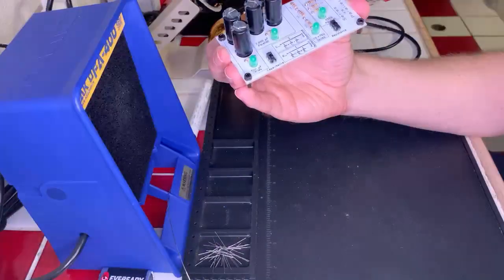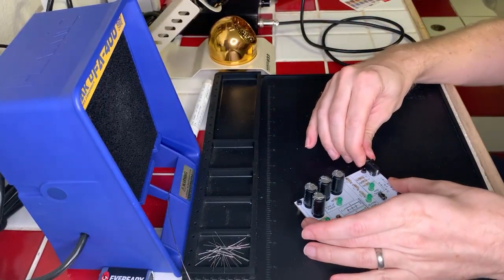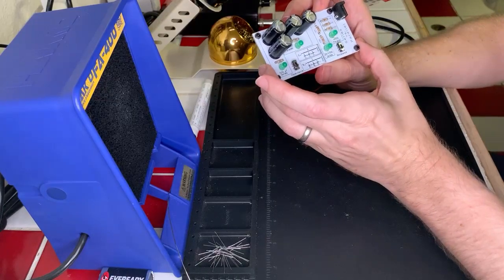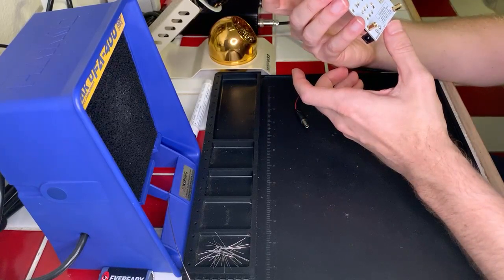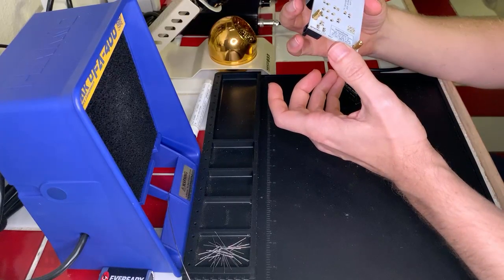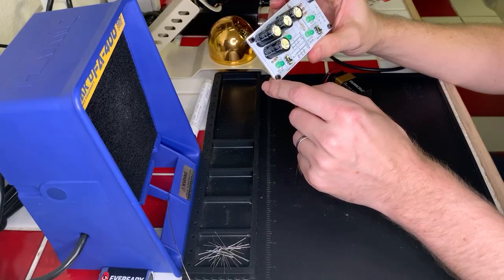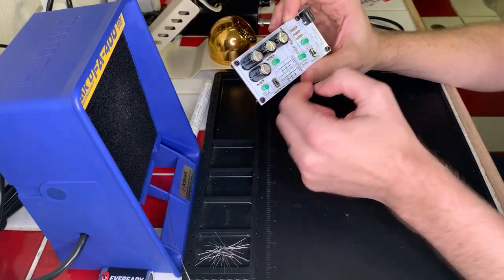All right, let's get our light back on. And then it is time to move on to the next board, which I think we're going to have time for. Yeah, we definitely have time to work on it. Okay, so that is our series versus parallel project. And we can learn from that instructions. Turn on capacitance switch. When you turn it off, notice how long it takes for each light to turn off. To calculate parallel capacitance and series resistance, simply sum their values. Okay. So you just sum the capacitance here, 2000 microfarads of capacitance, and this one is 500 microfarads, 2000 microfarads, 500, and then yeah, we calculate the whole thing.